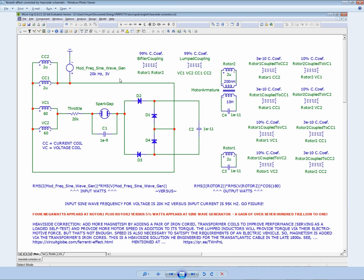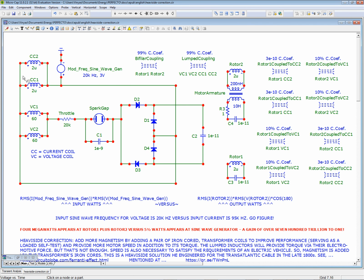Because I had a hard time bringing down that 4-to-1 relationship. And I thought to myself, well, how are you going to change the speed on this? You got to have some way to regulate this. Previously, I had considered the possibility that you multi-strand this, and then you use little transistors, switches, to disconnect some of the parallel strands. But I never found good over-unity from increasing this bifilar beyond trifilar. It was better on these current coils to make them multifilar. And I went as high as 8, I think, was the maximum efficiency. If you add more, you don't gain a whole lot, but you would be able to regulate the current of these current coils.